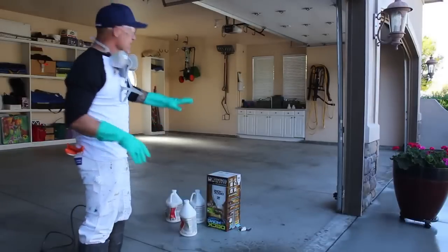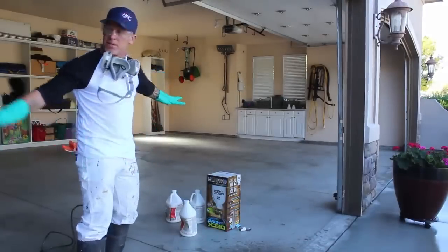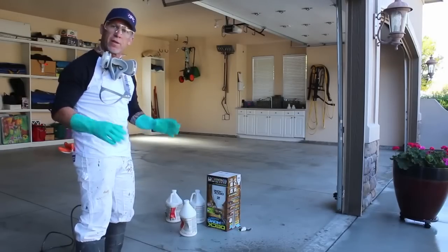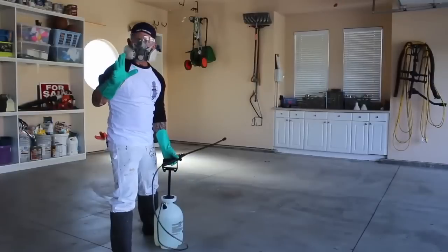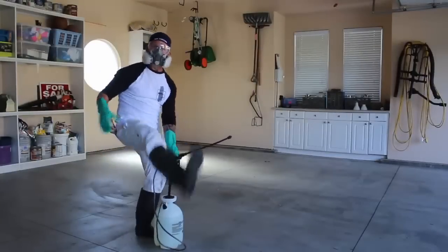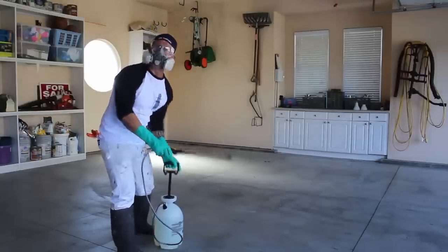Now I'm gonna start applying my acid. I'm gonna start in the back of the garage. I'm just gonna be working my way to the front. Once I get the acid all on the whole floor, then I'm gonna rinse it out. Okay, here I'm going. Ready to go. Got my mask on, safety glasses, rubber gloves, got my boots on, and we're gonna start this acid etching.